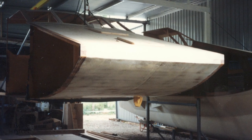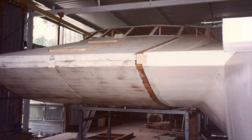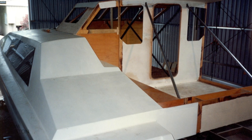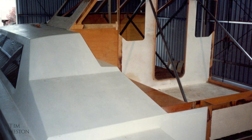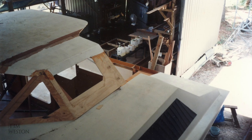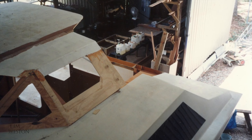I cut my own fiberglass tape from the roll using a dressmaker's cutting wheel — picked them up in a dressmaker's shop. This is an awesome way to cut fiberglass without causing it to lose its shape. Once the hull and bridge deck were aligned the gaps between the edges were filled with epoxy, sanded smooth, keyed and glass taped. Once the tape dried the two sections became one. The strength of the join is the same as or stronger than the rest of the hull, so there's no weak point at the join. Epoxy, wood and fiberglass as a system has excellent fatigue strength.